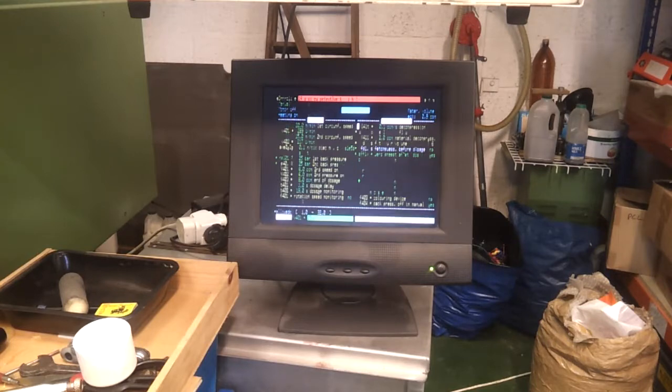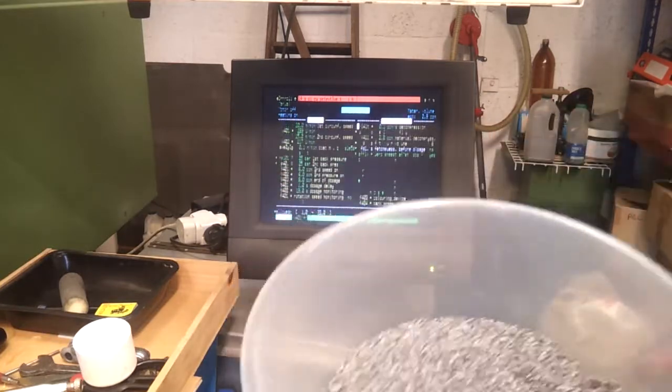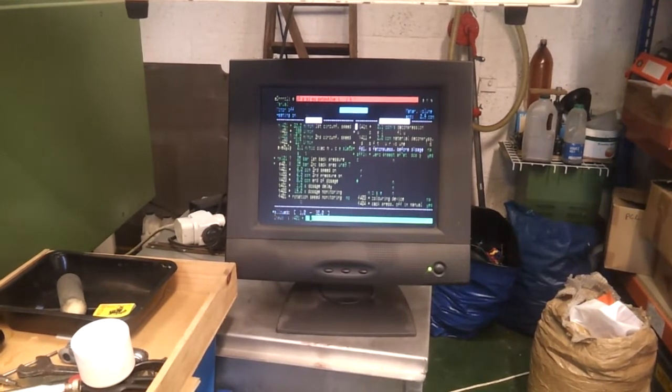Now the material that is in the machine at the moment is a polyurethane, and that's a polar molecule, whereas this stuff that I'm going to be running, this TPO, thermoplastic polyolefin, that's a non-polar plastic, so they're not going to blend. It's basically like mixing oil and water, so I'm expecting the first few cycles to be a bit rough, but we'll see. It'll take a while to purge out, but then hopefully we'll get some good mouldings, and with a bit of luck they'll work and grip onto a cane. So let's just get this thing set up and running and we'll give it a go on the moulding side.